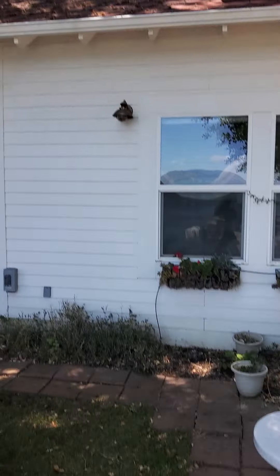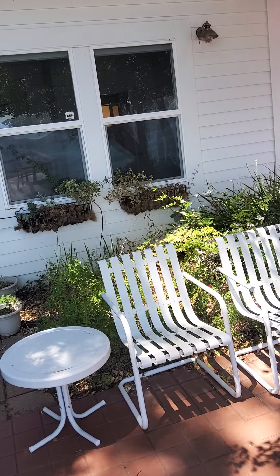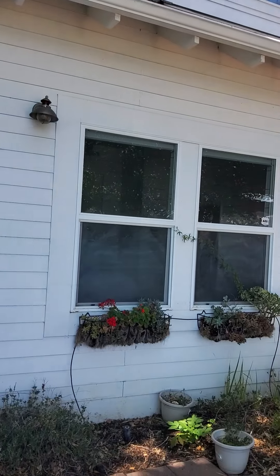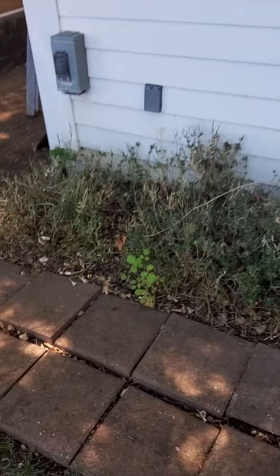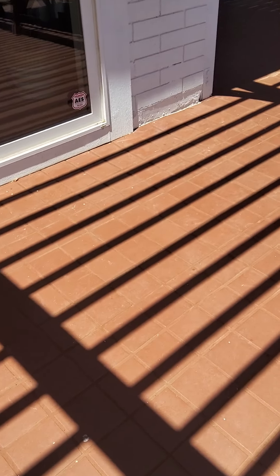This moss buildup up there — I was able to get my drone right up close to it. This is an 8-in-12 pitch and I wasn't too concerned honestly. What you also have is a rafter cut-and-stack system on the inside, so there are no trusses. When I see this amount of cuts and angles, it usually means it's a really skilled builder, since cut-and-stack roofing isn't something just anyone can do. Also, you've got really good flashing above these windows, which isn't required — it's an extra precaution.